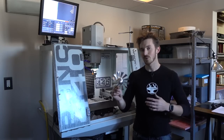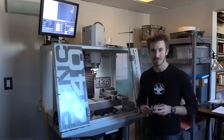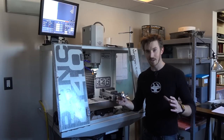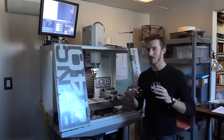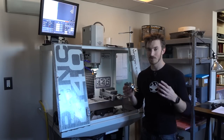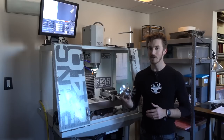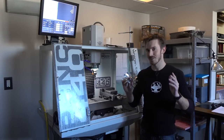For us, since we're only making a few, it makes a lot more sense to spend a bit of money and have them CNC machined. We would CNC machine them at home with our Tormach PCNC 440 milling machine, but the bed size on the Tormach is a bit too small for the EDFs we want to make. It would be possible to design a bigger EDF with individual blades that slip into a central hub and do that on the Tormach, but that could be a couple hundred hours of engineering design time. Depending on the supplier, they might be able to do the dynamic balancing themselves, which is important because a dynamic balancer costs a couple thousand dollars.